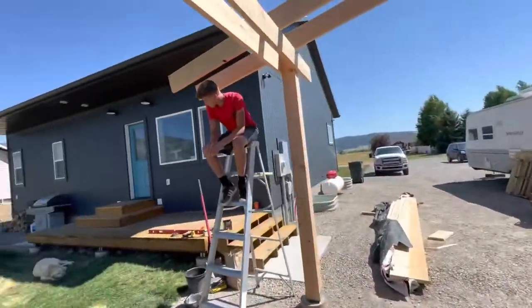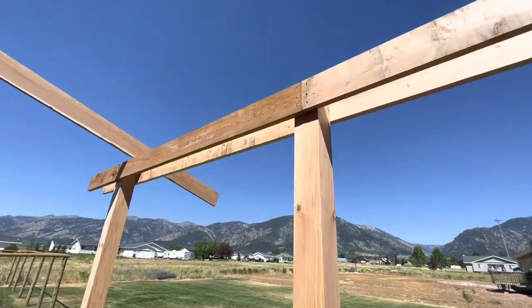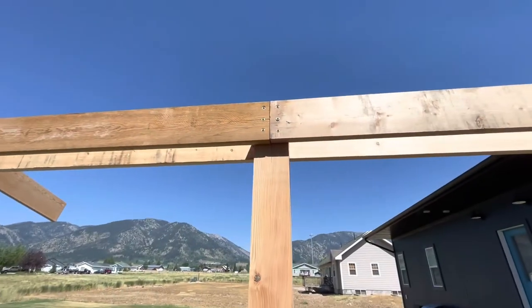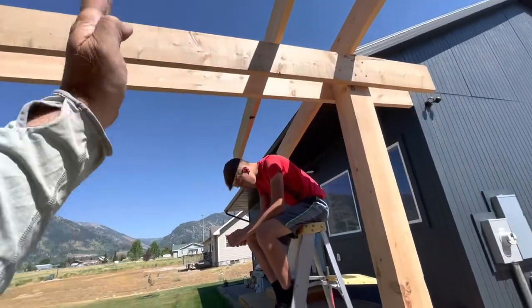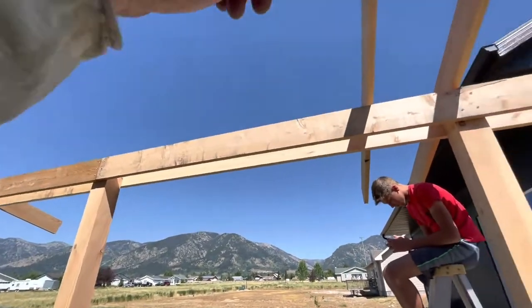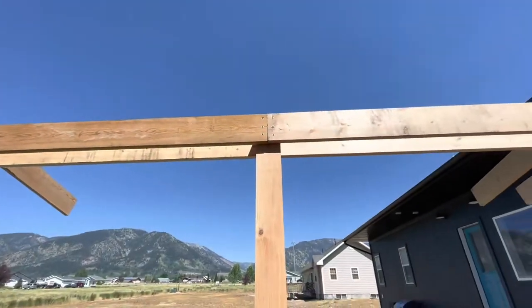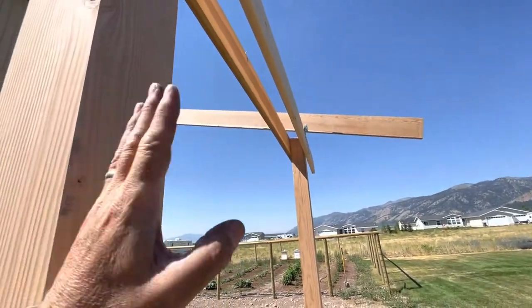We pre-drilled the holes for these headers and I'm going to come back in and put some more big heavy-duty lag bolts or lag screws. I'm also going to put some block pieces in between and reinforce it a bit with screws. You don't need them on each side because these aren't sitting on the inside board. We got them up into place and did the other side so the unit with the two boards was standing in place.